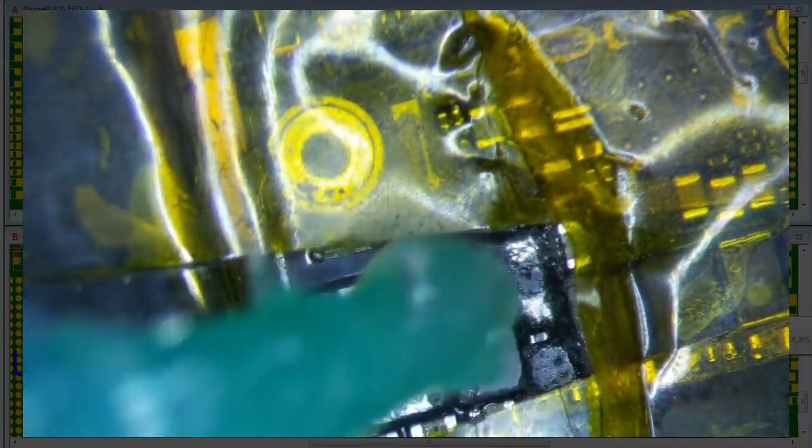Let's do, I don't know, probably the glass diode first. Yeah, since we have the Kapton on it, we might as well do the glass diode first. Making a little bit of a mess here. Just remember that diodes are directional, so don't forget that. Get my heat sinks back here so I don't jack anything up.